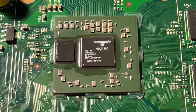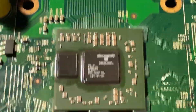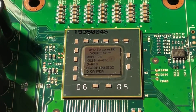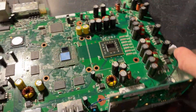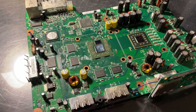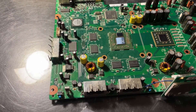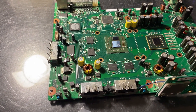Microsoft did repair this board with a Korean Y1 GPU, so it's nice and reliable. For the CPU, I have soldered on one of these Waternoose DD1XCPUES — it's a 2.8 gigahertz chip. No 1BL in there. Had to do a few other things on the board. We've got a 64 megabyte NAND Flash installed there. I also added the 5P0 LED for a 5P0 cell. I'm going to add the yellow LEDs here, but I don't have any more, so I'm waiting on those to come.